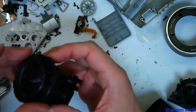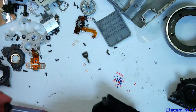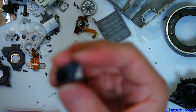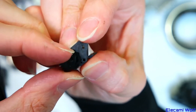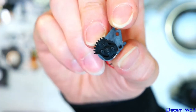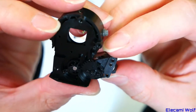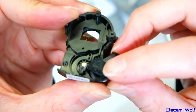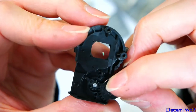So the other little shutter thing is the actual exposure shutter — not two separate devices. There's a cog that winds around, just flipping from one state to another to drive it across. It's got a removable IR filter. This little solenoid thing has a very short amount of turn on its spindle, and that flicking from side to side gets amplified through gearing so it can wind the filter the whole distance — about a quarter to half turn.